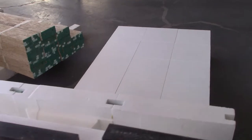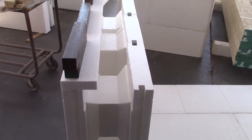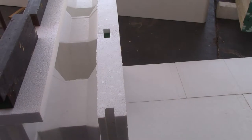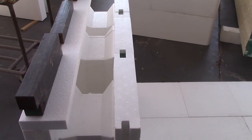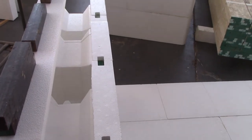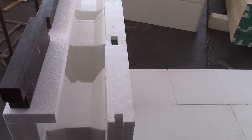And that's where my hollow metal door is going to get filled in, and when it's grouted, the door jamb will be right here and it will get filled in with grout. Door swings in. God forbid you end up in a storm with a motorhome on your outswinging door. So I like to swing them in.